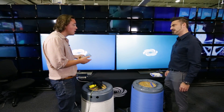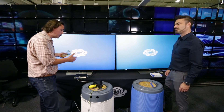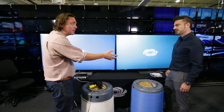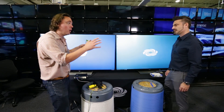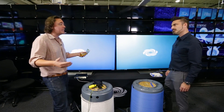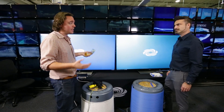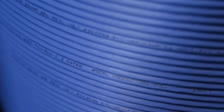So tell me about the setup. Sure. I've got the same video source going through DMNVX on the left here and a 10 gig video distribution solution on the right here. Both of them running through 100 meters of cable. Although another important distinction is that DM only needs CAT5e, so I'm going through 100 meters of CAT5e. 10 gig solutions need CAT6a, so we're going through the more expensive CAT6a cable with that solution.